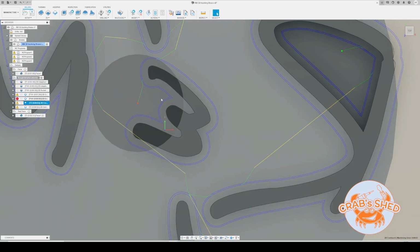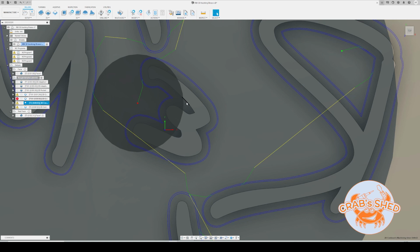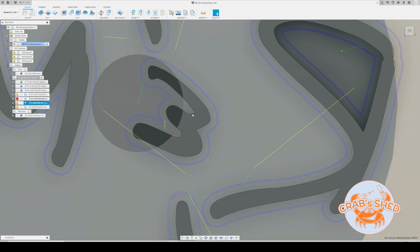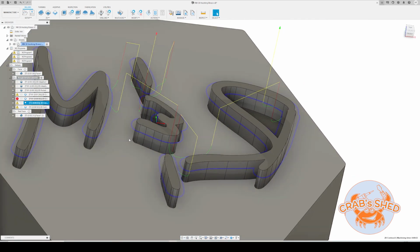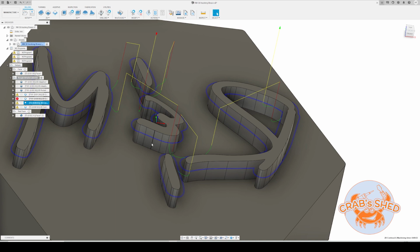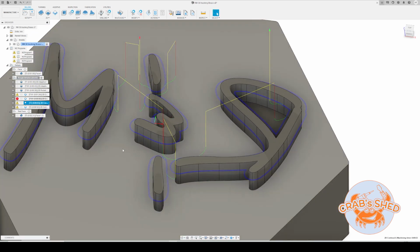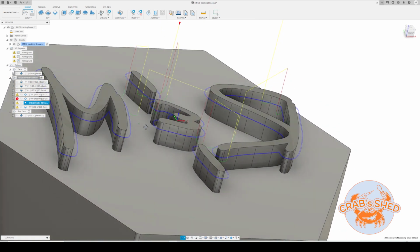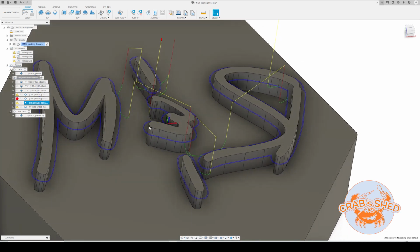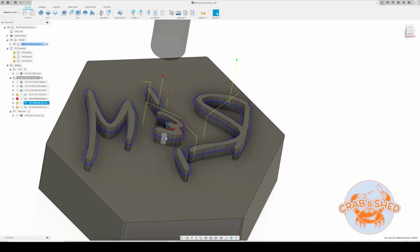See here, so it machines a bit more material out of the tiny details. Hopefully that should be enough, and can skip or avoid using some sub-millimeter tools, which I don't like to use too much. They might work, but they need to be slow and add another tool change, so better to skip it, and if it works okay, it will save some machining time.